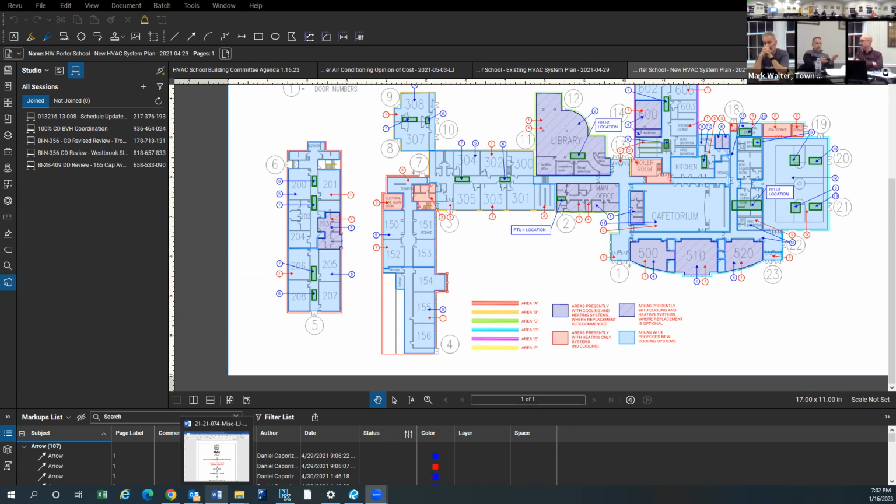Right, because I assume your RFP would be written broadly, where, like Jason was saying, you dehumidify this location, provide ventilation and air in this location. A designer could recommend multiple types of spec, like a VRF rooftop unit or equivalent that provides similar function. So we're not locked into anything necessarily. Because really, it would be what we're proposing to do the construction. We have the spec saying they're looking at this, or what else could I recommend in lieu of a VRF rooftop unit.